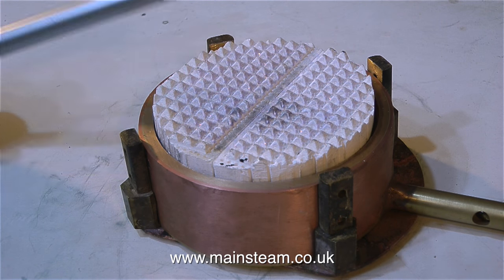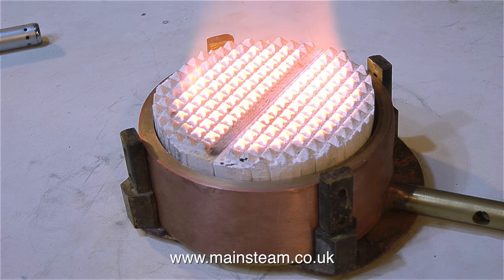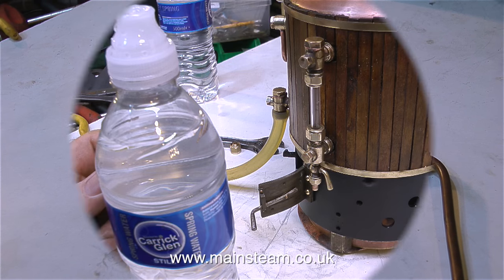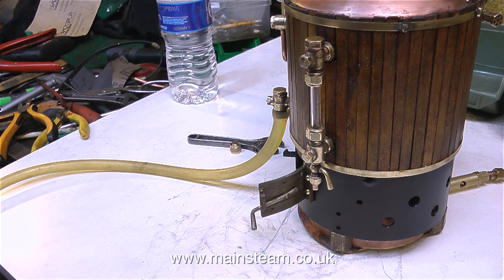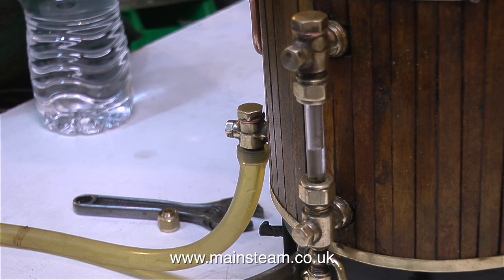It's now time to light the burner for the first time and see what happens. And it's quite good — that's what I want it to look like. Nice and red and rosy, and very, very hot. As you can see, there is no gas escaping around the edge of the burner, and that's perfect, because this burner sits in a firebox that is full of holes — if there's too much flame, the flame will come out of the holes and burn the boat from the inside. I'm actually quite pleased with this burner. The gas burns very cleanly, and there is no bad smell in the workshop. Some gas burners do not completely burn the gas, so you get a mothball smell. Usually this is down to not having enough oxygen for complete combustion, and you can get a carbon monoxide problem — but I don't think I'm getting it with this burner, and I'm very pleased about that, because I haven't died.